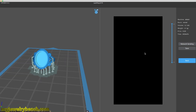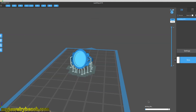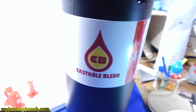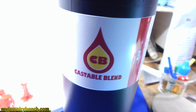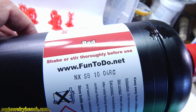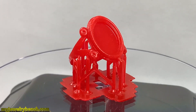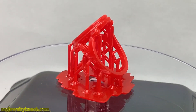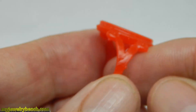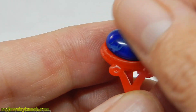These resin printers print much better at an angle. I'm checking the slicer to make sure everything sliced well, saving the file to a memory stick. I'm using the Fun to Do castable resin — it's a really good resin. The end result of the print is this; the first version I didn't like so I reprinted it. I've taken off the supports, cured it, and I'm going to test fit the stone to make sure it fits.